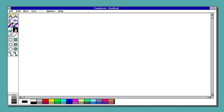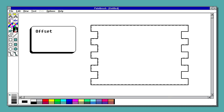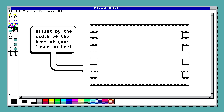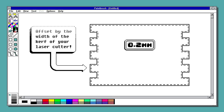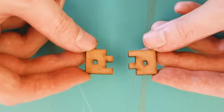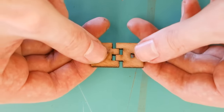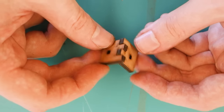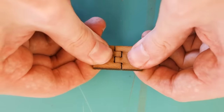So how do we solve that? Well, once you've finished designing your box you need to simply offset all the cutting lines by the width of the kerf. In my case the kerf ended up being 0.2mm, so I offset the cut lines by the same amount. Once cut, the pieces should have a snug fit. Looking at this second test piece we can confirm that is the case — it fits, it is snug, but it holds together quite well even when we let go of the pieces. This is exactly what we want.